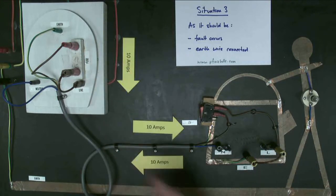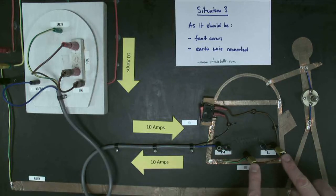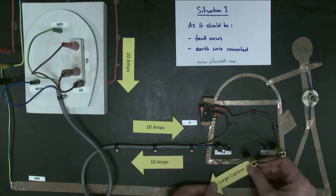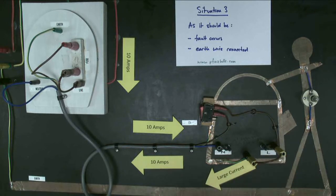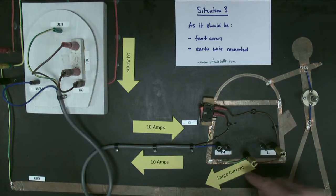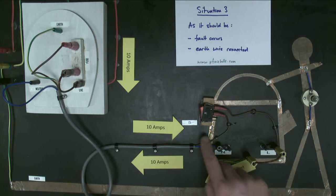The fuse is broken. The kettle's gone off. But most importantly, the person is not being electrocuted. What happened? We connected the live, which is at a high voltage, to the earth, which has a very low resistance, so a large current was able to flow through the earth wire. That large current had to come from somewhere — it came along the live wire, which delivered current to the kettle and a large current down to earth through the earth wire.